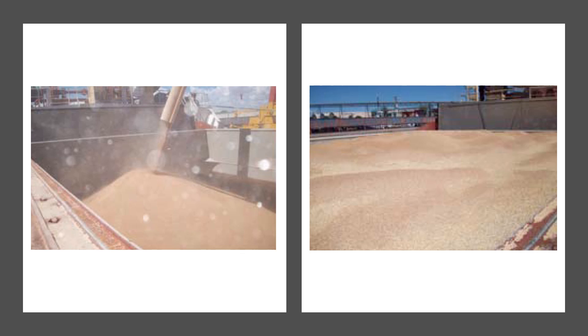During the wash down, loose paint or rust scale will be dislodged, particularly where the water is delivered by enhanced delivery systems or high pressure jet systems. Depending on the nature of the previous cargo, this wash down may be sufficient, but with certain cargoes, residues or staining may remain even after a thorough wash down. To remove these, it is necessary to use targeted chemicals.